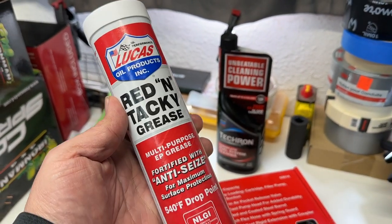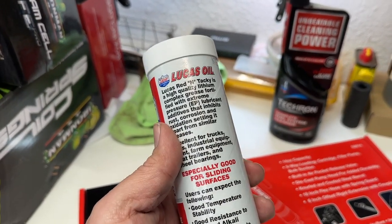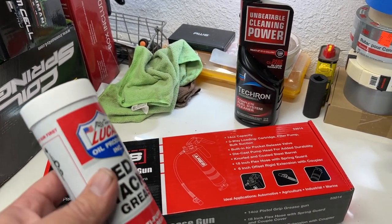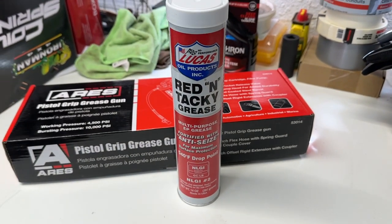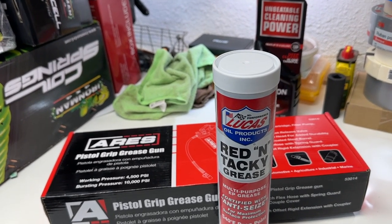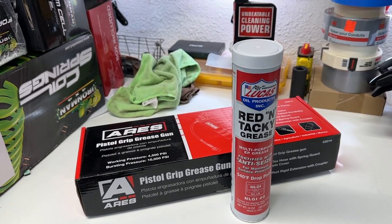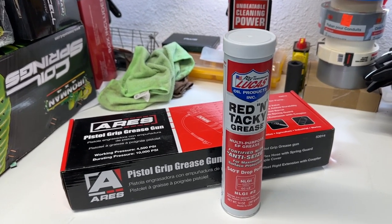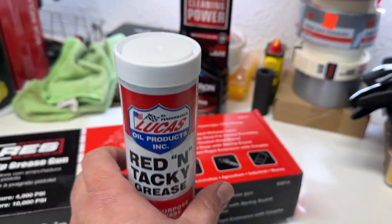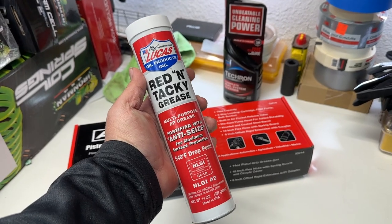Lucas as a brand makes an extra heavy duty green one that is polyurea-based, which is a heavier duty, more ag/industrial type grease. The lithium-based one has a little bit better wear properties. If all you had was the other kind or one that wasn't rated correctly, it's better than nothing — most people never do this maintenance and never have a problem. But if you're going out buying new, just get something that is NLGI 2 and lithium.